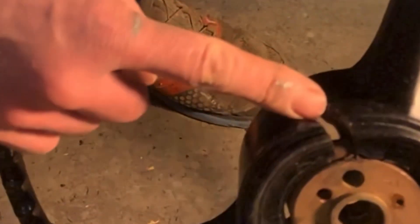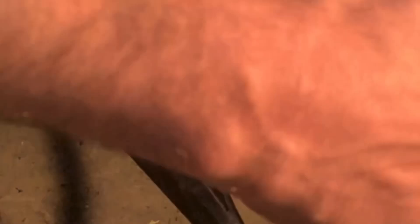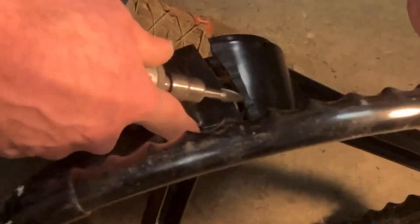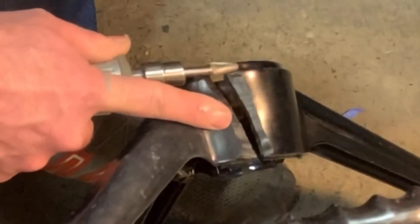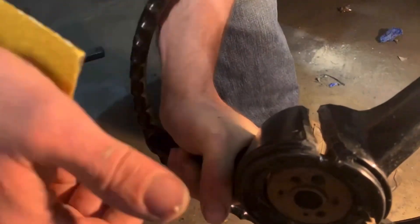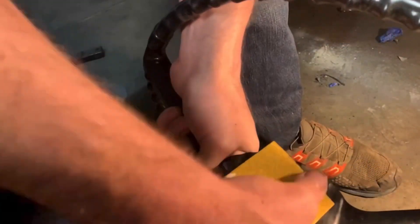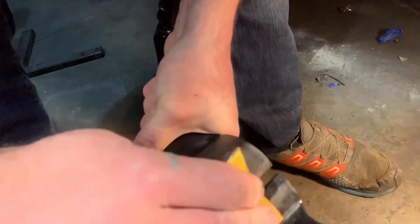Now take a look at that — kind of cut that back at an angle, so it's all tapered back. So I put my epoxy on there — it'll actually be a wider patch and I hope it stays in place. I do the same thing to the other side of the crack, just kind of taper it back or bevel it. Now we've got this all V-grooved — a nice channel for that stuff to all sit in. I know it makes it wider and takes a little more material, but I think it's going to hold up better. Now with this 80-grit sandpaper, I'm just going to key up, scratch up, scuff the leading edges here, so whatever goes past my opening I have a fighting chance of it actually biting in. It's opening up the surface too because it's a pretty slick surface.